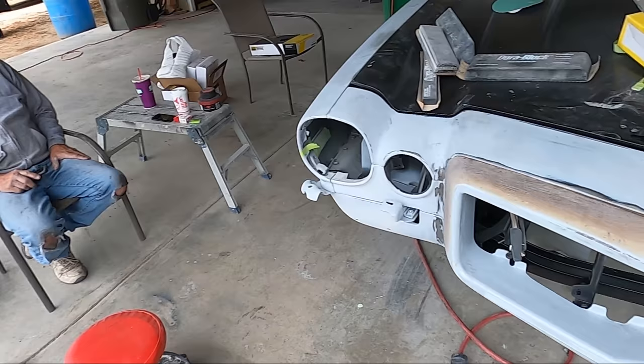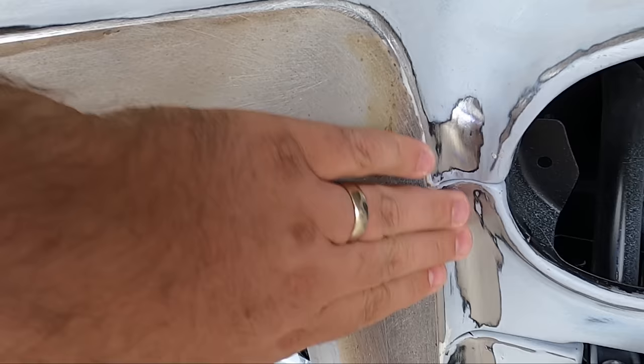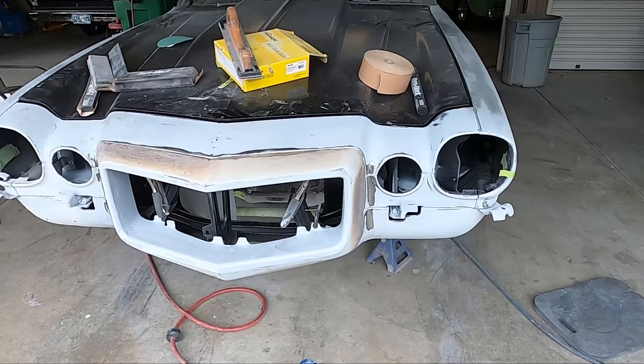Now it's taking the nose off, building up the back side, rounding out the corner to roll into the back, and filling it in with a jelly resin to get rid of all the pinholes. If you look at the sanding there's little pinholes all throughout it, but it's literally fiberglass layers. He started with a big, then a medium, then a small — was it seven layers at the thickest point? But the jelly resin will fill that in and make it look nice, smooth and perfect. Full faith in Heath and he came through, winging it.